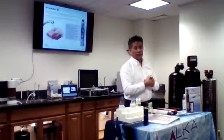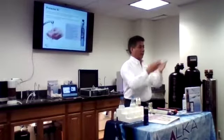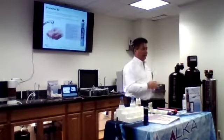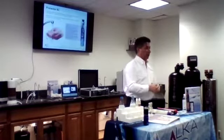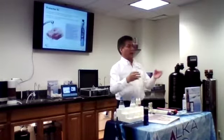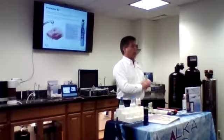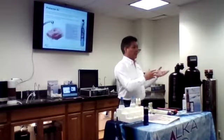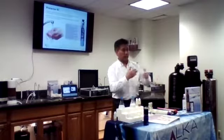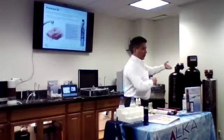Because the bill will show their use in 100 cubic feet. Not really. It's about the usage of the water. You've got to ask how many people are in the house and what size piping they have, because probably that house, like I was telling you, has only 3 people in it. Now you compare the usage of gallons of another house, a smaller house that has like 7 people in it. Probably the one that has 7 people will use more water than the bigger house. Yeah, but the bigger house also requires a bigger system because of the high flow faucets. So it's information that you guys need to know before we do the installation of the system.